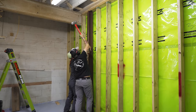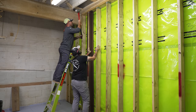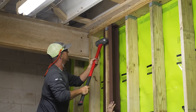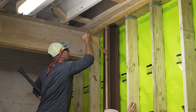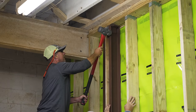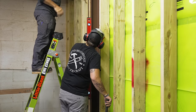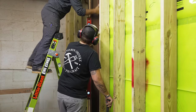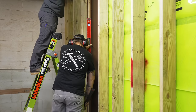Once the primer dried, we got to work installing the supports in the walls, which required a little persuasion in a few spots. We'd cut pieces about a quarter inch short to give some wiggle room, but they were still tight in places. To install, the guys first butted the support tight up to the block wall towards the center so the steel would brace the concrete block — the whole point of installing it — then roughly leveled the support, making sure it wasn't proud of the 2x6 framing.